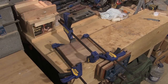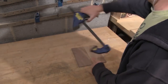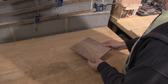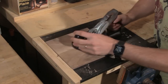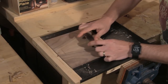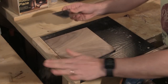With that nicely held, I'll leave it to dry overnight. With the glue dry I remove the clamps and see what we've got. I use a plane to ensure that the board is flat across its entire surface and to remove any glue marks, then do a final card scraping for smoothness. Walnut looks really nice when it's finished, so it's worth making the effort now to get it as smooth as possible — that way it's going to look as good as it possibly can in the finished piece.